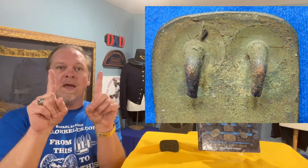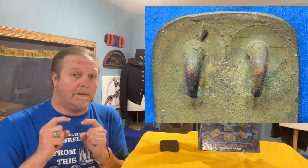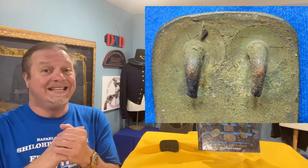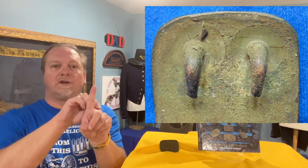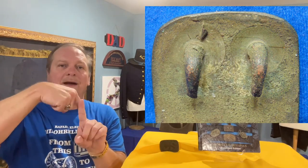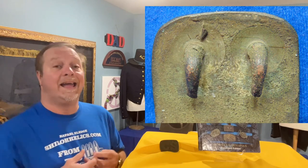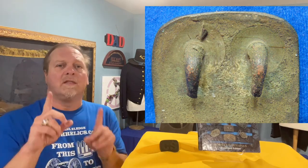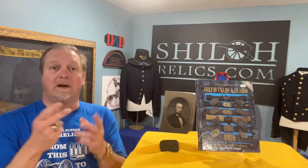When those hooks were cast straight up, they bent them down after it was cast. Very durable, very solid buckle — because if those hooks cast correctly and didn't have air bubbles in them, they wouldn't break very easily since it is cast brass. But what did they do to finish those hooks? When they were still straight up, you had burrs around the base of the hook. They took a lathe and spun it down and ground off those burrs, because that would have torn your belt. They call them spun hooks. In Steve Mullinax's book, he refers to them as a spun hook Confederate buckle. You can see the spin marks on these very clearly. They spun them and then bent them down, so you have those two things on the back of the buckle.